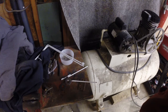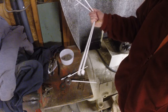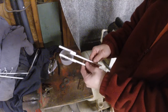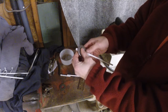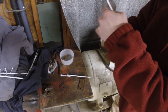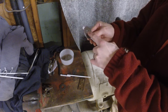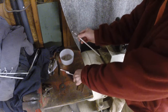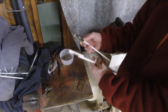I need a valve compression tool but I'm too cheap to buy one, so I'm going to try to build one. I have some old hangers with the ends cut off. My plan is to weld these together, cut that kind of in half, grind it down so the valve will go on it, put it on a hinge, and make it compress the valve spring. This is step one.